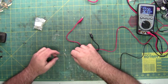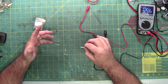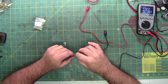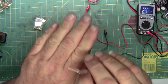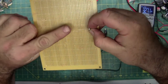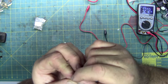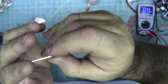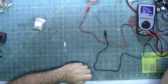In that unit, they soldered them in series, so if one of the four LEDs goes out, you're going to lose all the power to them. And if you exceed the power, you're going to pop one, probably the first one in the row. On an LED, there's one pin longer than the other — that's your positive, and the shorter one is your negative. There's also a flat spot on the negative side of the LED.